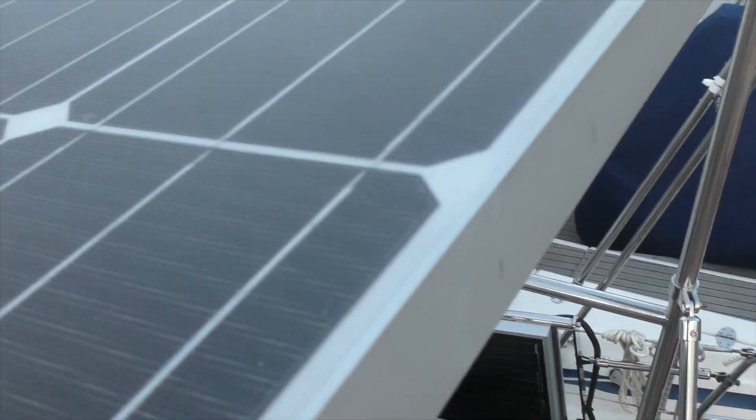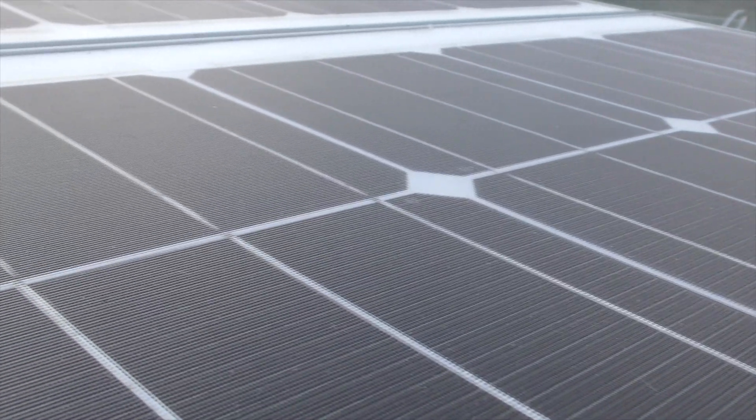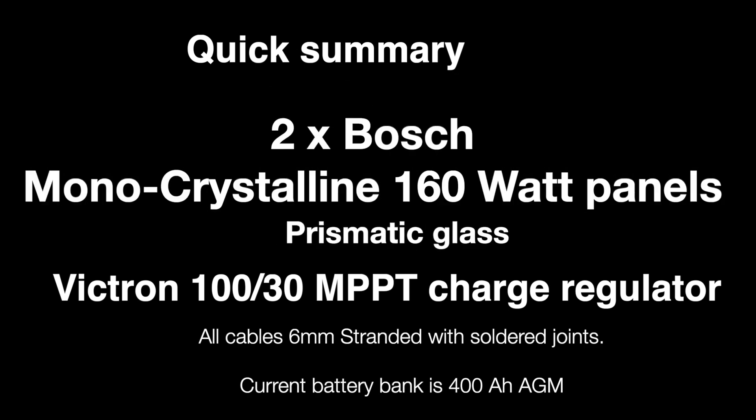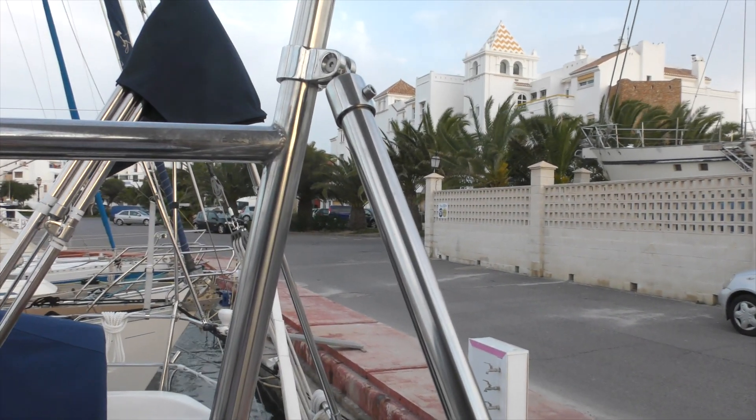Here you can see the prismatic surface to the glass. So here's a quick summary of what we've fitted to date: we have two Bosch monocrystalline 160 watt panels with prismatic glass and a Victron 130 MPPT charge regulator. All our cables are 6mm stranded with soldered ends. In winter sunlight in the Med we're currently producing a maximum of 250 watts. Our current battery bank is 400Ah of AGMs, and we also have a 75Ah start battery and a 100Ah battery which works our bow thruster and windlass.